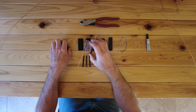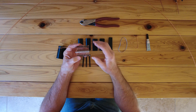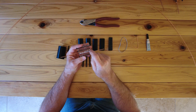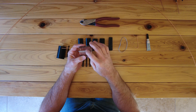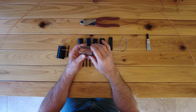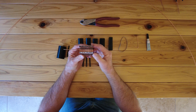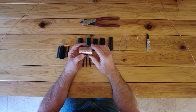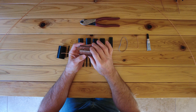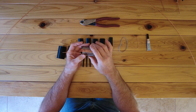This is a coil that I made using that technique. It has got a little bit of a taper to it. I used superglue to hold the windings in place on the strips. When I did that, I was in a hurry and just ran water over the superglue. Superglue is one of the materials that cures hydraulically — it sucks moisture out of the air to cure. I just wanted to speed that up, but it made it bubble up and look a little trashy. But the coil certainly is decent and functional.